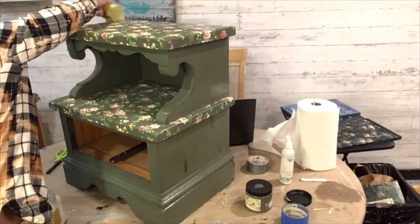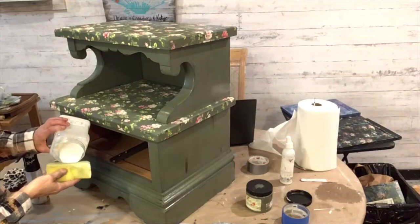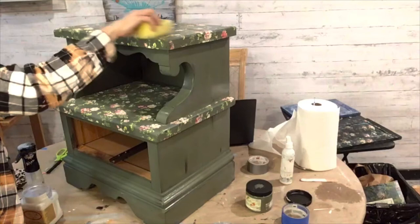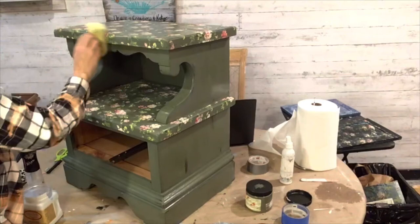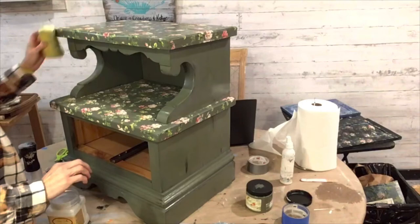We'll find out. I can also tap this if I want. But let's just push it to the limit and see what happens if we put the spray coat on before. And let's just see what happens. I do see some little raised fibers. I know what the sisters are talking about in their video now, especially when I'm at this angle and this light. So what I'll do is after this coat, I will take a real fine sandpaper, like a 220 or higher. I have one that's like 300 something.